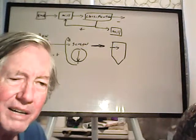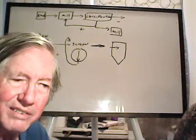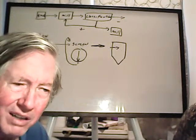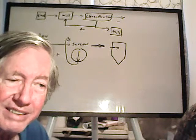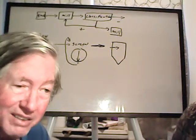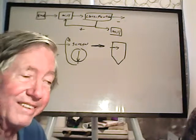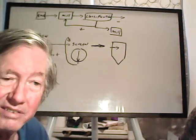I would think it would cause the temperature of the actual wire to go down, because with increased resistance, you should get a lower amperage, which means lower wattage. So the temperature of the wire should go down. It's all being dumped into the furnace, so it becomes a thermodynamic equilibrium situation. Obviously you can't heat the furnace any hotter than the wire is.